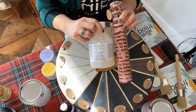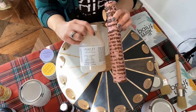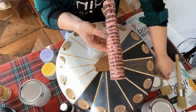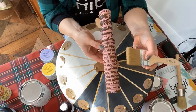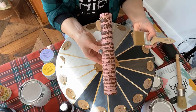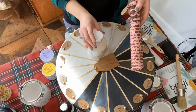75% of the time I seal my pieces with hemp oil, and the other 25% of the time I'm usually using Tough Coat. Tough Coat works like a wonderful glue — it dries super fast and can seal your chippy milk paint. When you apply it and brush it on, some of the little flakes might shift a little bit, but they're going to dry as you're painting. I do have other video tutorials on my Painted Facebook page if you want to go check them out.